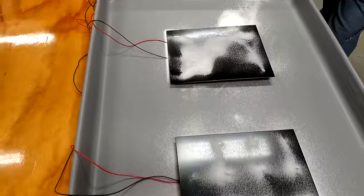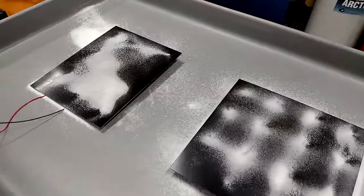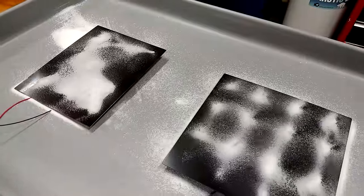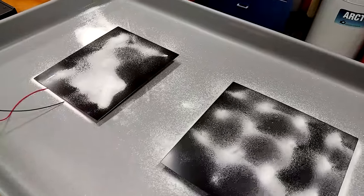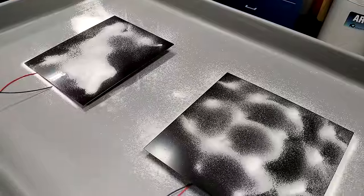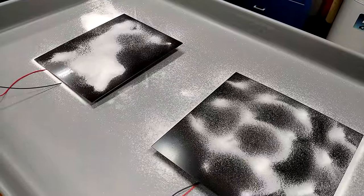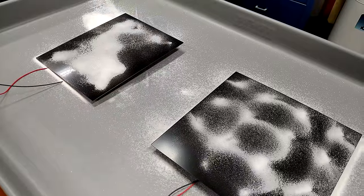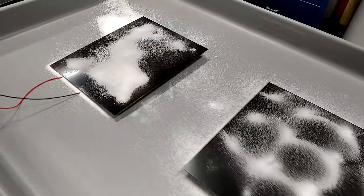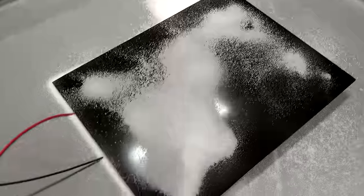It's that continual motion of the sugar on the right-hand plate — but a lack of tremendous movement at certain resonance peaks — that tells the story. You can see the square plate goes dead while the asymmetrical plate's sugar still moves. The asymmetrical plate is still producing a good amount of sound amplitude while the square plate is not.